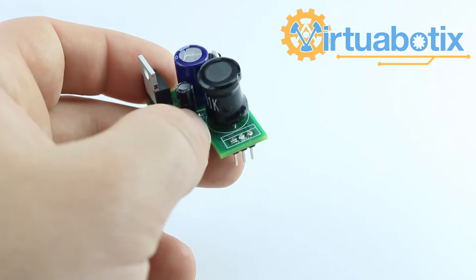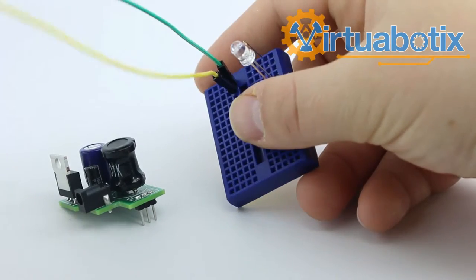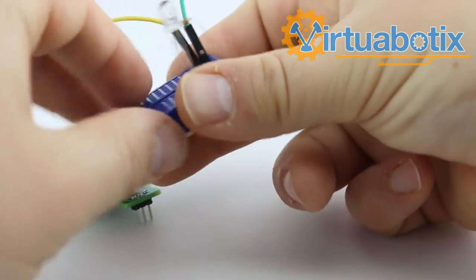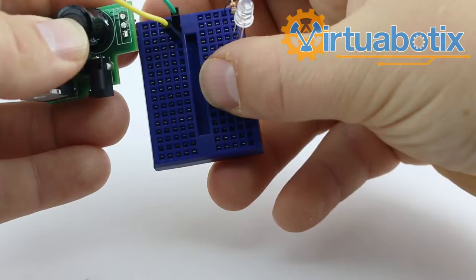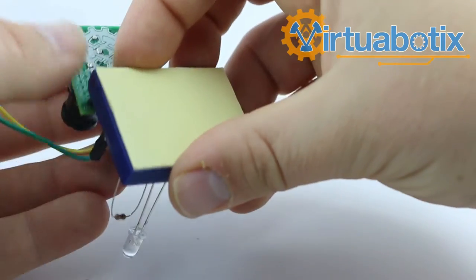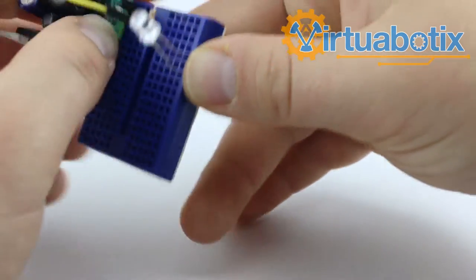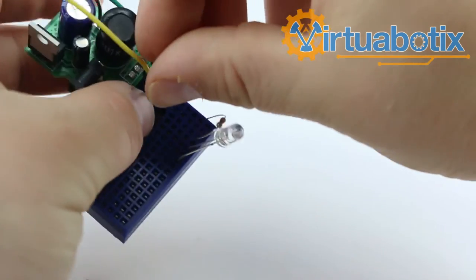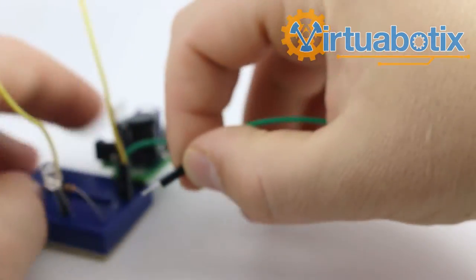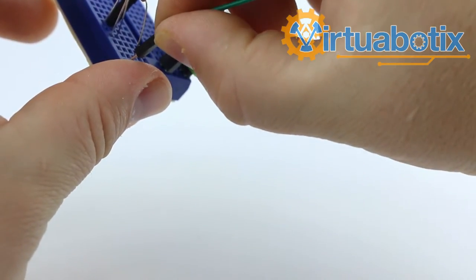Let me show a simple circuit using this. Here is a breadboard I've prepared. I'm going to take this off for now — all we're worried about is our regulated power and our ground. Here we have a resistor and a green LED. I'll plug this in here. You'll note it's plugged in at the top with one empty notch because V out is right there, so we want to move this over. We'll put V out here, and ground over here.